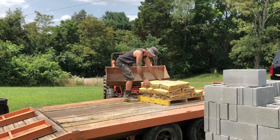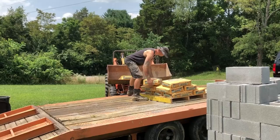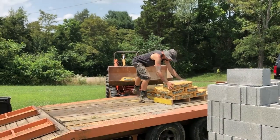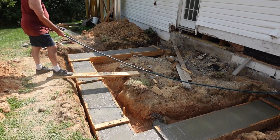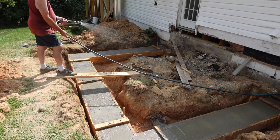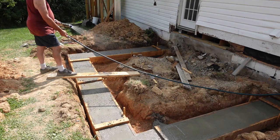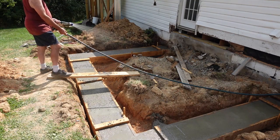So concrete doesn't just dry out like mortar does. Concrete actually dries chemically, and it dries harder and better if you keep it wet. And the sun was beating down and drying it out, so I sprayed a little bit of extra water on here. So the footers are done, as you see, and the next thing to do is the cinder block, which will be in the next video.